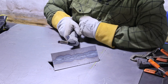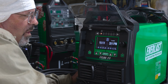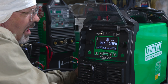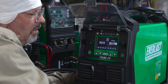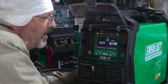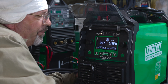Comes off there nice and easy now. The amount you need for electrical stick out — that's about what I prefer, because then I can just clip that ball off and I've got nice wire there. What is your stick out, by the way? About half inch? Call it three-eighths. Three-eighths to half — maintain that for electrical stick out, defined as the distance of wire from the contact tip to the weld pool. Not the nozzle — the contact tip.